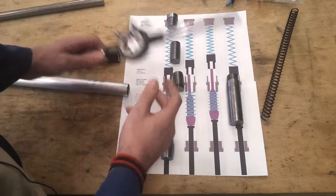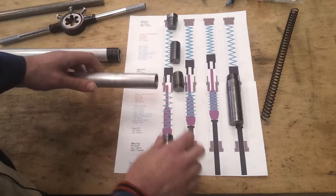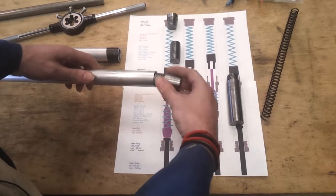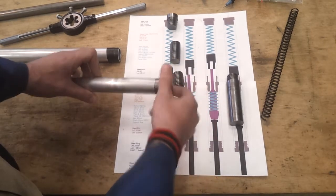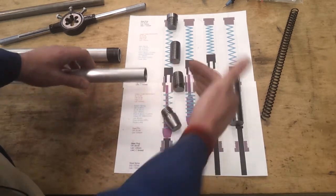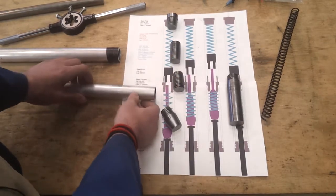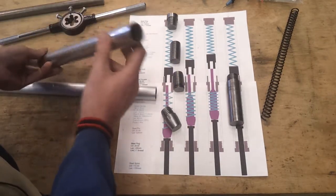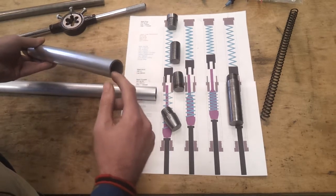Not the end of the world - I only paid about 10 quid for the die so we'll call that disposable. As predicted, the aluminium tube is slightly easier to cut. That threads in there quite nicely, but one problem I'm having is the die tends to wobble slightly, so trying to keep that dead centre is a little tricky.